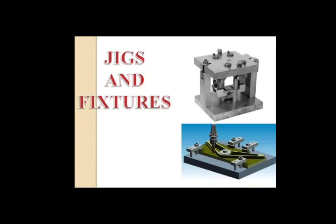Magnetic clamping. Permanent magnets or electromagnets can be used to clamp the metal workpiece to the base. Permanent magnets are moved under the table so that magnetic flux can be passed through the workpiece, which holds the workpiece magnetically. Now to release the workpiece, permanent magnets are moved under non-magnetic material, that is, it blocks magnetic flux and deactivates magnetic action. Now component distortion under clamping and cutting forces is the point that we have to discuss